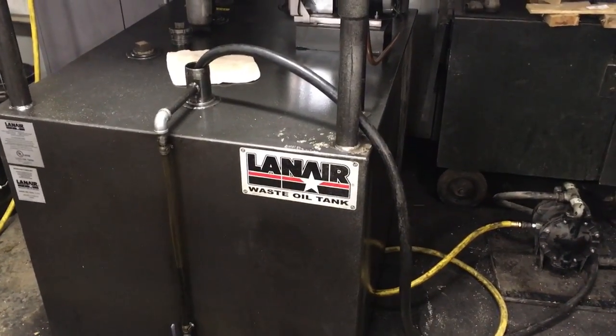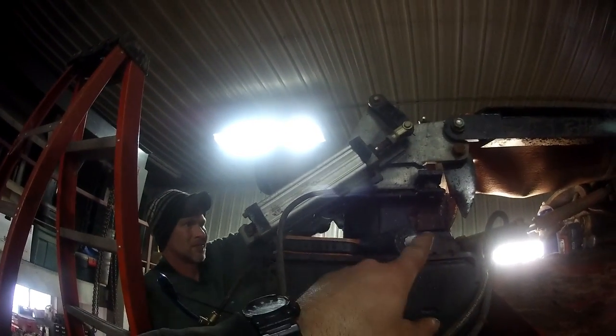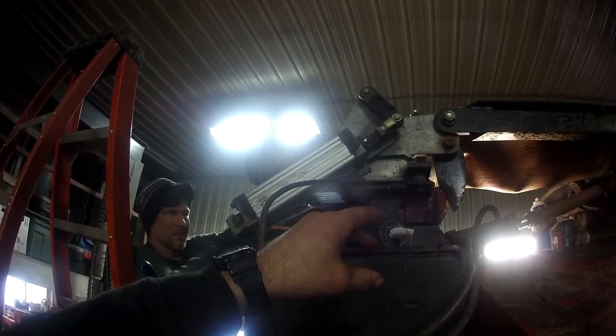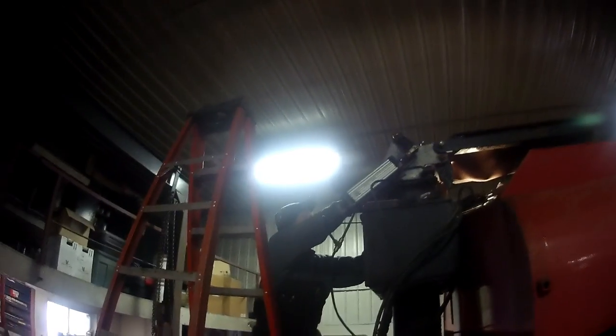Jay's working on truck 12 here — the gasket came out of the swing boom housing and he's getting it put back in. You can see where one ear broke off. He's got to get that welded back on; that's what caused the gasket to pop out in the front and started leaking manure out the front of that housing. We put those ears on there to give the front more strength, but that ear ended up breaking off, so he's going to get it welded back on in a little while.